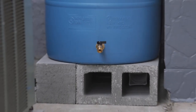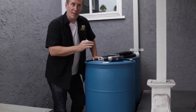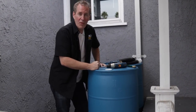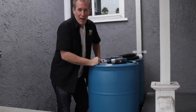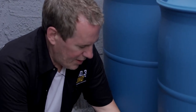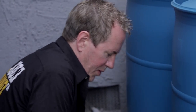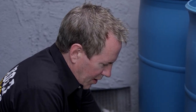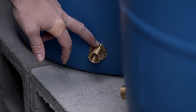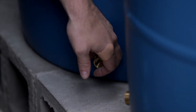I think this is where I want my barrels. Make sure you have them exactly where you want, because water is eight pounds a gallon. That means when these are full, they're going to weigh 440 pounds each — you better be happy with where you've got them located. The next thing I'm going to do is connect the two barrels. I've already put these bushings on — they're just two-piece brass fittings. On the inside there's a rubber washer to keep it sealed so it won't leak.